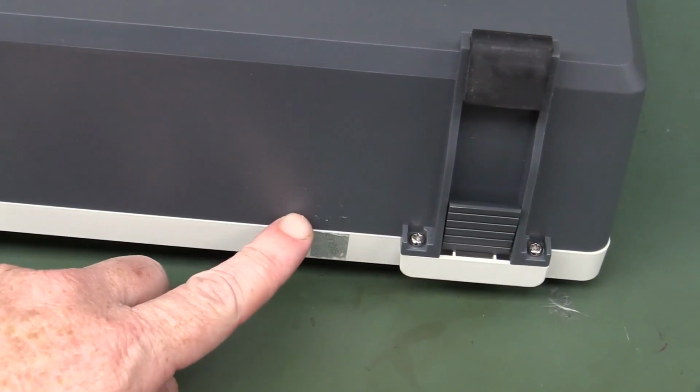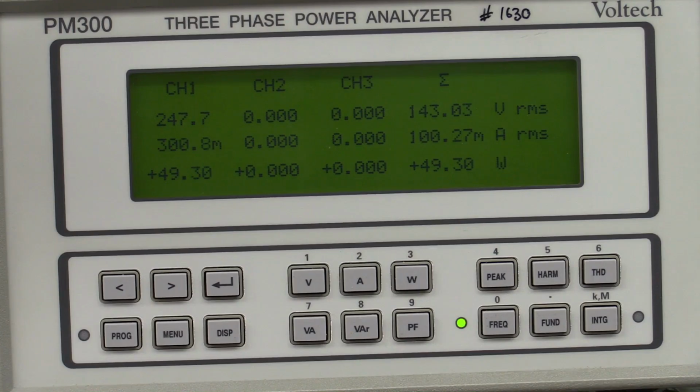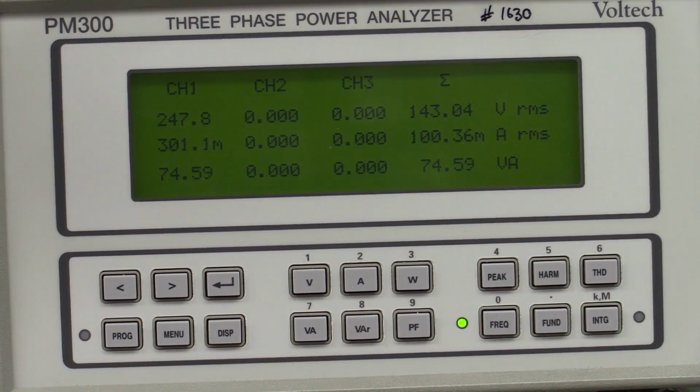I just noticed someone's had a crack at this before I did. Almost 7 watts standby power. You gotta be kidding me. Unbelievable. You can fly to bloody Pluto on 7 watts. And during operation, we're looking at about 40 watts there. Power factor of 0.65. And there's our apparent power for those playing along at home.